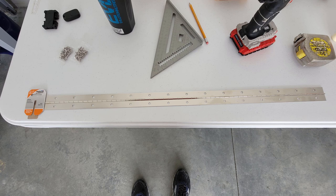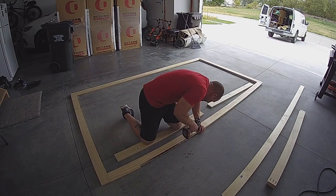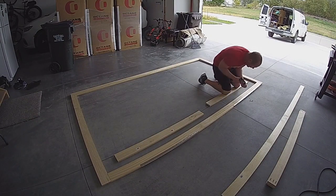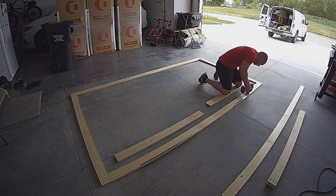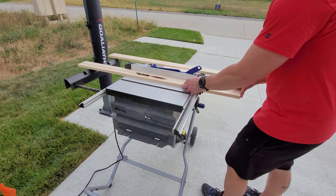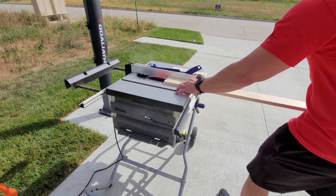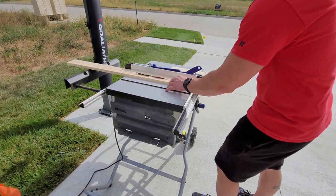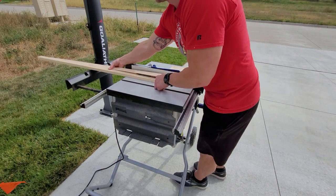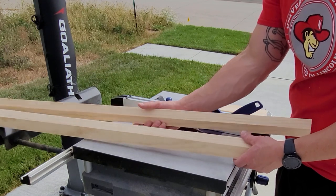Here are the two piano hinges I'm using to allow this screen to flip up, allowing access to the cavity that is behind it. I'm attaching the piano hinges to the very top of the screen — they will connect to a 1x4 that is going to get turned into a French cleat. To make a French cleat, I used a table saw to cut a 45 degree cut down the middle of a 4 foot 1x4. The French cleat is a type of mounting bracket: one half gets mounted to the wall and the other half will be mounted to the screen. When you line them up, the 45 degree cut in the middle will hold it to the wall.